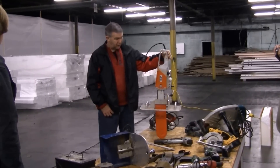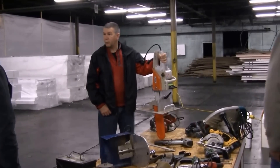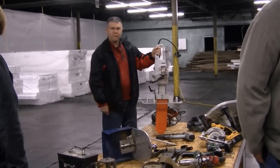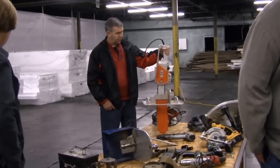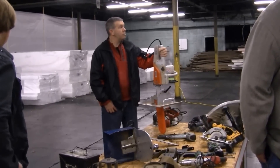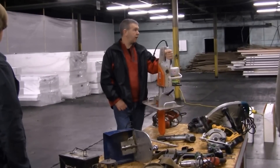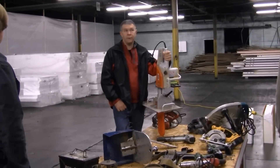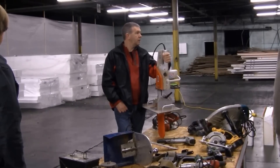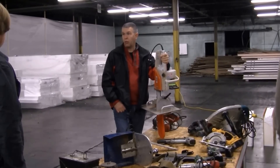The bases — the SIP School actually — these are a combination of ideas and designs that we've developed over the years, and we have these made and sell them to the students. I think that base is $550. It's very nice, rolls over, holds onto anything you want. If you use a gas chainsaw, remember that the dust is abrasive. When it gets through your air cleaner and into the cylinder of your brand new Husqvarna saw, it's shot — it'll tear it up in a heartbeat. So extra air filters or changing the air filters frequently is a good thing to think about.